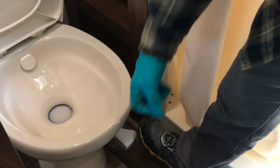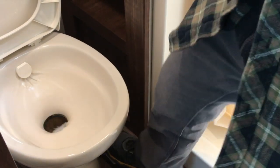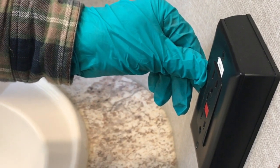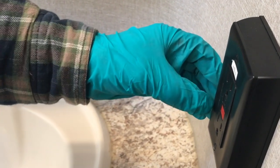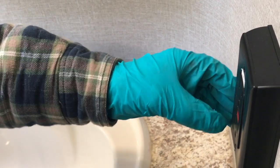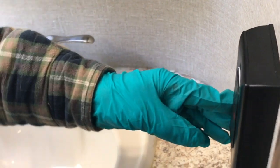The toilet has a foot flush — it is a porcelain toilet. Depress a little for water, all the way down for the trap to open, which flushes your toilet. We also have a GFI outlet here. Any outlets near water or on the outside will be tied to this GFI. This is your reset, just like a GFI in a household bathroom. If it trips, press it here. If that doesn't fix the problem, check the breaker in your control panel.